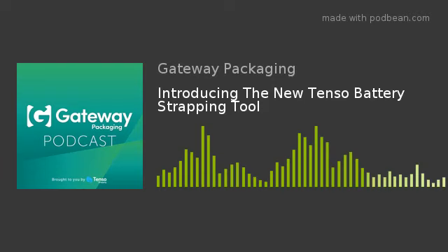Being a 16 and 19 mil strapping tool, it can take a 16 mil wide and a 19 mil wide strap. Some tools out there will only do up to 16 mil, and that's something we like to educate everyone about. Don't get caught buying a tool that you think will do everything, only to find later you want to move to a 19 mil strap with a higher break strain because your pack configuration changes. Make sure the tool you buy has the capability of stepping up — you always want the option to grow with your business.